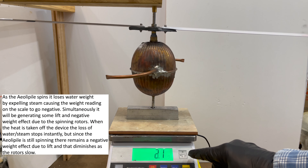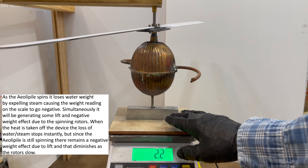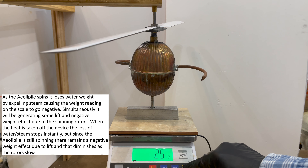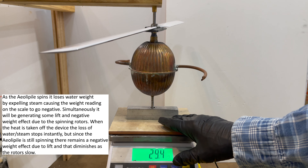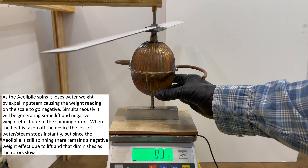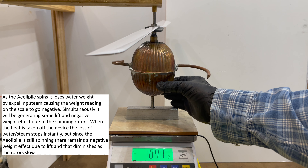This is on a digital top-loading balance. Right now I haven't tared it or anything, but if you push down, see it's reading 2.1 grams, which doesn't mean anything. Let's tare it here, go to roughly zero. You put weight on it, you get a positive number — this is reading in grams. If you lift weight off of it, it goes negative. A negative sign appears. That's how I can tell if I'm getting lift.